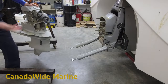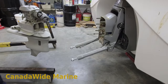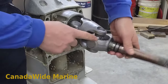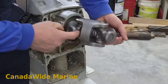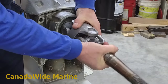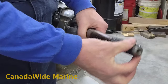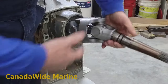Let's have a look in here. First thing we're looking at is the universal joints - you want them nice and loose. Wiggle them back and forth; you don't want to feel any notchiness. If you can see signs of rust poking out from the bearing surfaces, there's probably a problem. These are nice and floppy and loose with no excess clearance - they don't rattle back and forth. Universal joints are good. Drive shaft splines are nicely greased with no damage. We do this every season - these splines need to be greased every year, otherwise you'll eat up your coupler and drive shaft pretty quick.